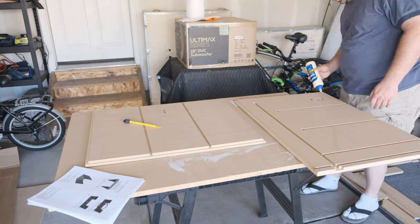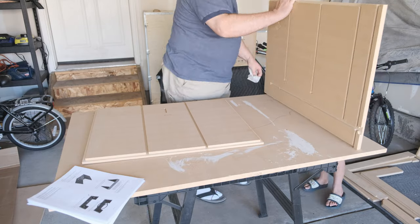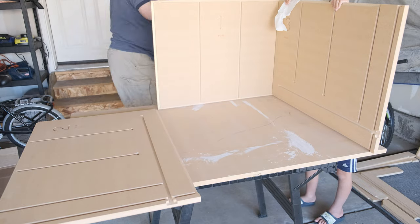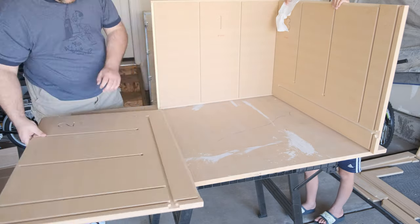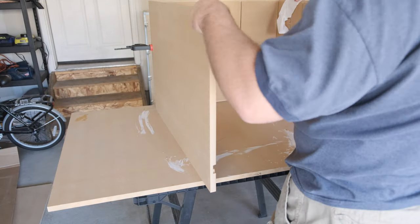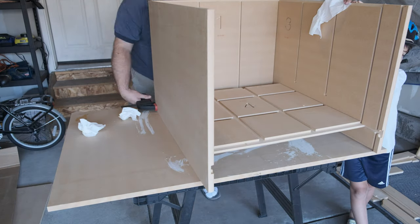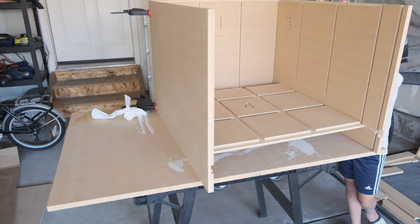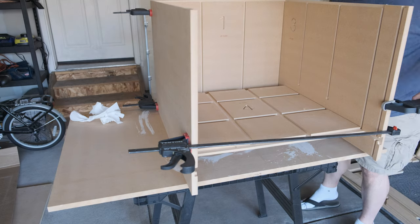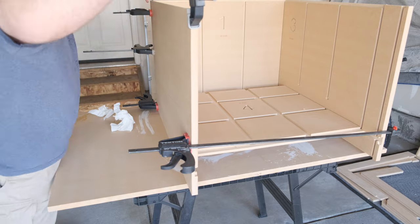This first piece of the build is really the trickiest part. You've got to get these three pieces of wood glued together and there's really nothing for them to hold on to while you're doing it. I use a fourth piece of the box that fits in at the farther end as a brace so I can clamp everything up, but I don't glue that one in. Make sure that the piece at the top of the U is set correctly — there are two ways it'll fit in, so look closely at the instructions.